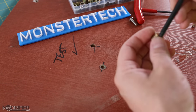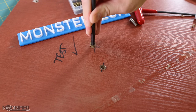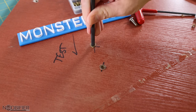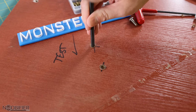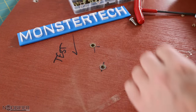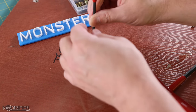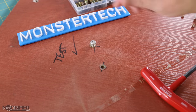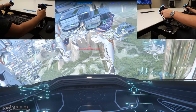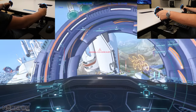When I was considering the most reliable way to get this rail mounted to many surfaces safely, I investigated a threaded metal insert in lieu of a wood screw. The advantages here would be more surface area for the thread to grab with hopefully less chance for the insert to pull out. The advantage would also be a metal-on-metal thread instead of just a screw — you could attach and remove the rail over and over again without becoming worried that your mounting point would be ruined. There was no need to overly tighten the six bolts; everything snug resulted in a very stable mount.